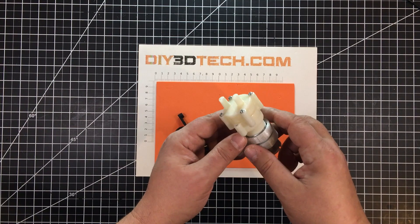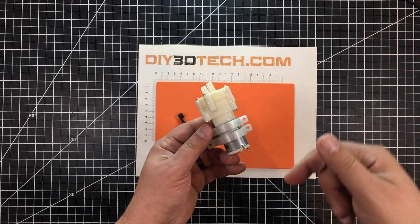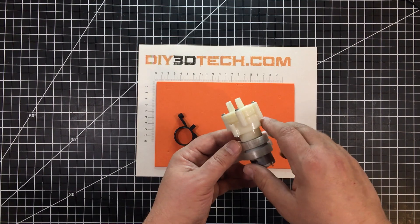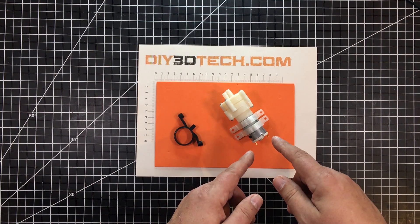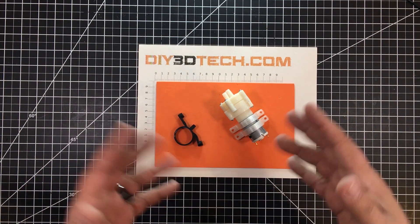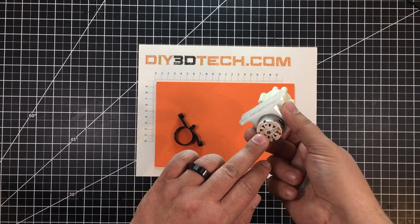I printed these out of TPU and I specced them to mount on the collar which sits over the motor. I'm not sure exactly why they put these collars over DC motors — if you know, put it in the comments below: is it EMI, is it just cooling like a heat sink? Anyway, I left it on there and designed around it. When I put this up on Thingiverse, I'm going to put two versions: a large and a small one for the collared version, and one for just the motor, so if you don't want to use the collar you don't have to. I grouped two of these together and printed two of them, so I'll have four mounting bolts to attach these to the back of the K40 laser, and then I'll run power back here.